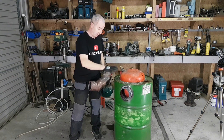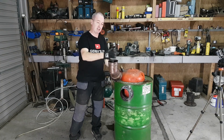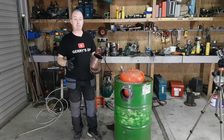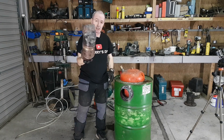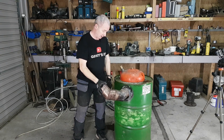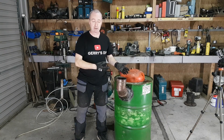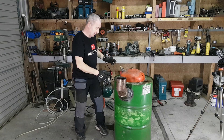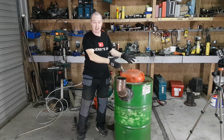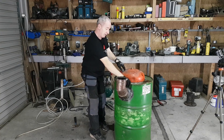So that's as far as I'm going to take it tonight. I've got a socket for my five inch flue on the back of this. Essentially what I'm going to do is put a socket into it and go up as high as I need to go, just to get rid of the fumes. I don't expect there to be any smoke - there shouldn't be any smoke. I've just welded the socket, it's still red hot. This is five inch pipe - it fits in there. I can set it up without needing any fiberglass rope or whatever, it's a nice tight fit. The fumes, when I light this thing - this is full of water - the gases come up around the outside, red hot burning gases, head for this flue and up into the atmosphere.